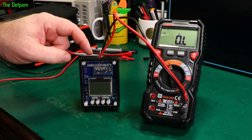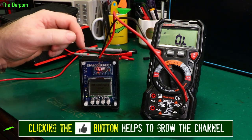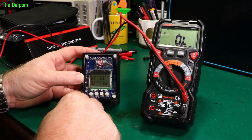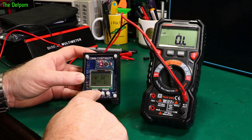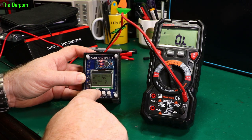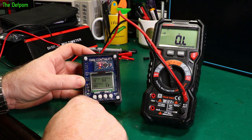So I've got Ian Johnston's DMM continuity tester hooked up. I put it into a box. At 250 milliseconds it is triggering it, though it starts to skip a beat every once in a while. 250ms seems to be about the limit. About 260 milliseconds is what it actually takes to reliably trigger it.